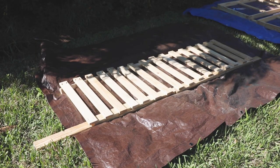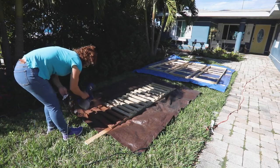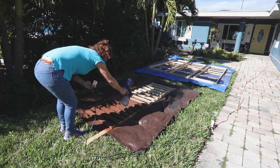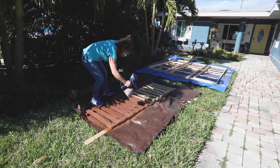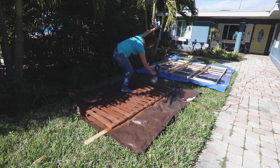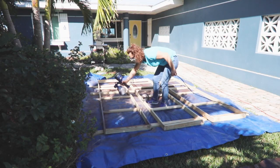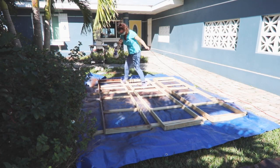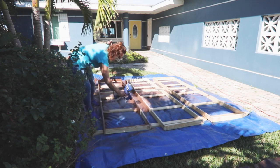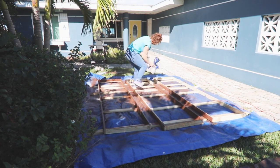To get a good finish, elevate the frames and rails on 2x4s and place a drop cloth under to catch the excess paint. To paint the rails, apply the paint in steady back-and-forth motions on an angle from one side, then move to the other end and do another pass from that side. Paint the frame the same way, applying paint at an angle from one side and then the other, holding the Finish Max about 12 to 15 inches from the frame.